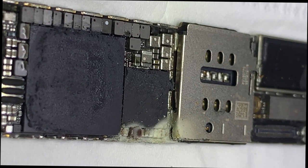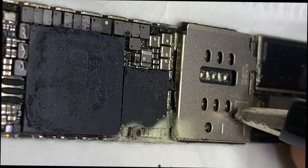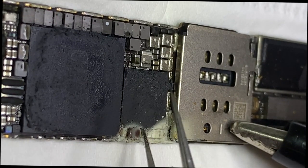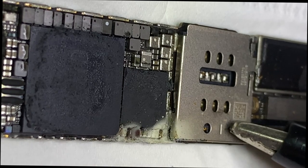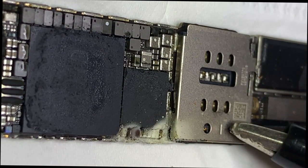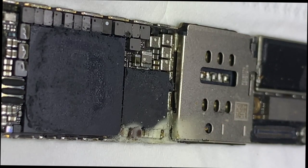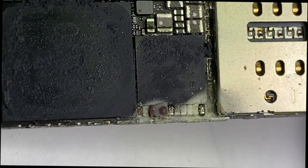After diagnosis, found that PP_VDD_MAIN was a faulty line. There are so many parts on that circuit — the rosin smoke method is the best method to find the fault. While we inject the voltage, the capacitor glows and shows as faulty.